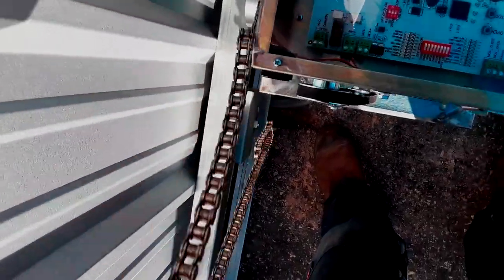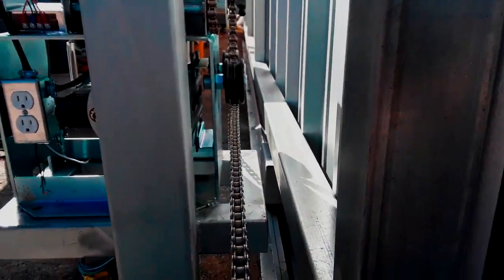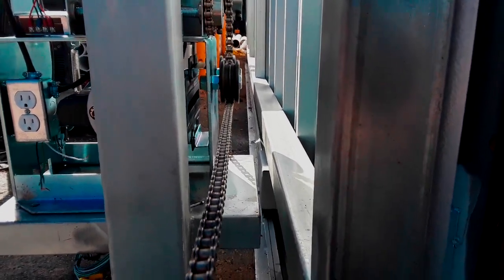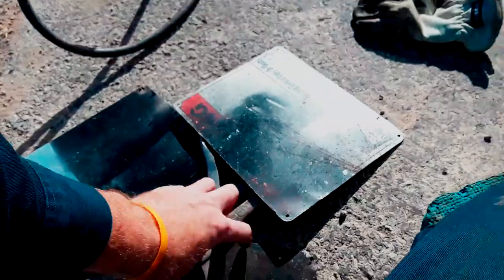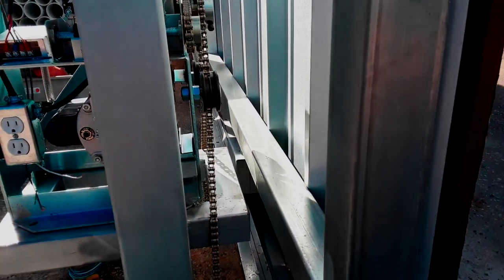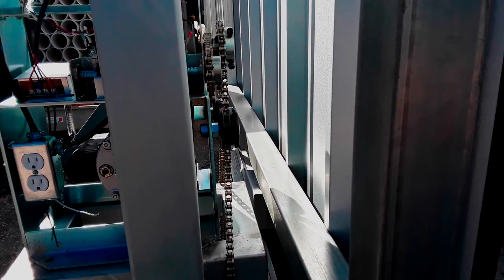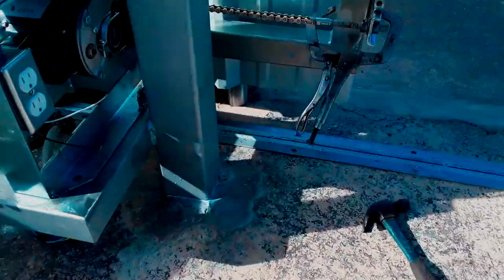This is a six-to-seven foot piece of chain. I'll wrap it around there, get the knee pad - that's the most important thing - and then get it lined up left to right, then up and down. Once we get to the spot we like, we'll clamp our chain bracket up there and use one of those clamps. We'll get it level and then tack weld it on there, then do the same thing for the back.